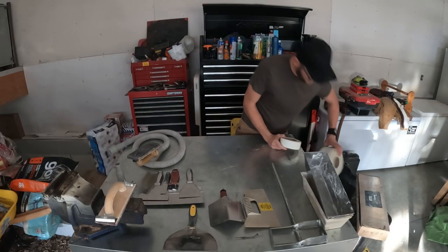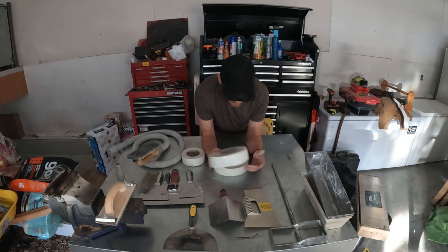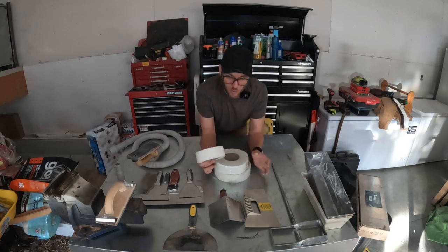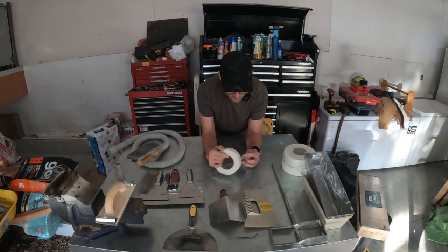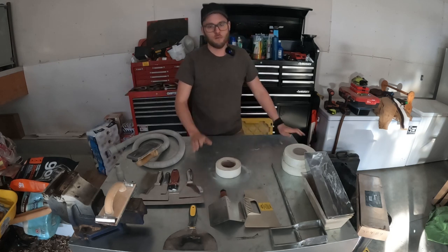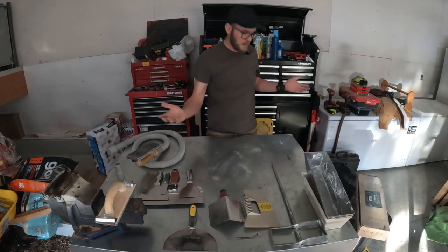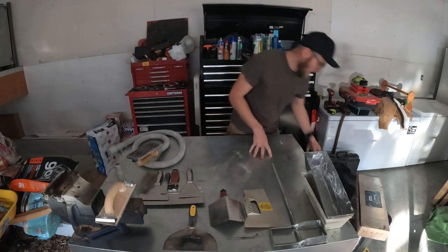Here's something that's going to hit the ditch for sure — three rolls of fiberglass drywall tape. There are 57,000 reasons on YouTube for why you should use fiberglass tape versus paper tape. If you're patching a pretty decent hole or doing rental repair work, this self-adhering tape works: cut it, stick it, mud it, and you're pretty good to go. But in my opinion, this is repair tape — it is not for finishing a room from brand new. Paper tape: because you can do corners and work with it like a normal human being without being super frustrated.